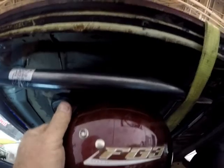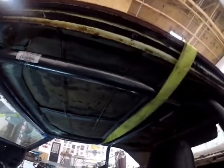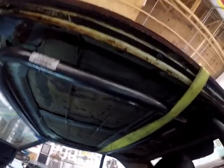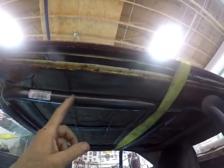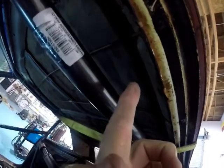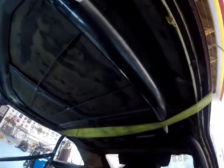So I have to somehow, and I've already called and checked to see if they had the dimensions from this side to that side over there, and they don't give you that, unless you call the company and maybe they will give it to you. I also learned on a frame car that this bar has to be 1 3/4 inches, which it is. So I've been trying to get 1 3/4 inches here. Well, come to find out, if you're building the cage, then this doesn't have to be 1 3/4. It can be 1 5/8, which is what this is. So anyhow, we're all right there. But I need to get these bars over here somewhere, which is still not going to give me a whole lot of room. I mean, that might give me an inch, maybe 2 inches.